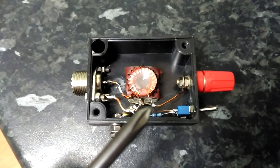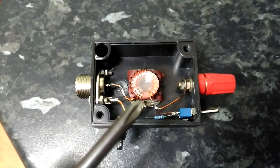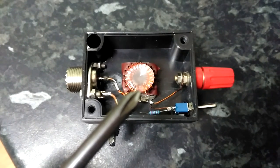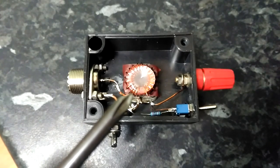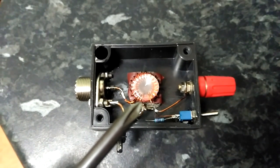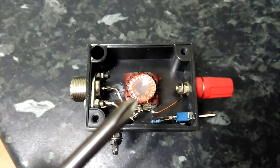This resistor will mimic the impression of an antenna. You will find that when you put on the analyzer, whatever it's resonant to — whatever the resonant frequency is — if you cannot get rid of all of your inductance, so by inductance I mean X on your analyzer, if you can't get rid of it, open or close your primary winding a tiny bit with your finger, just squeeze it open or close it a tiny bit, see which way it goes. You can quickly get rid of it, and when you've got rid of it and it's working right, you will see 50 ohms on its resonant point.